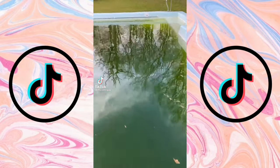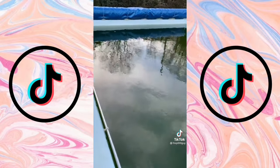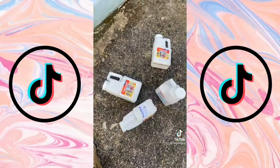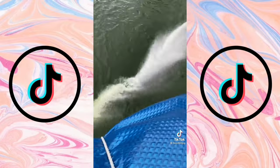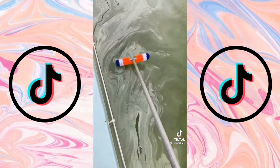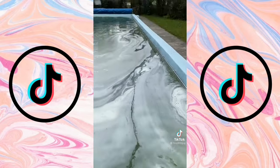All right then. Come to this pool to get it ready for the summer, and it's pretty green. It's not a small one either, it's probably around 25 foot by about 50 foot. So there's a lot of shock that's going to go in, about four tubs. I'm going to sprinkle that all the way around the pool while the pool's running as well. Get the brush out, brush the whole pool, all the surfaces, and let that do its thing.